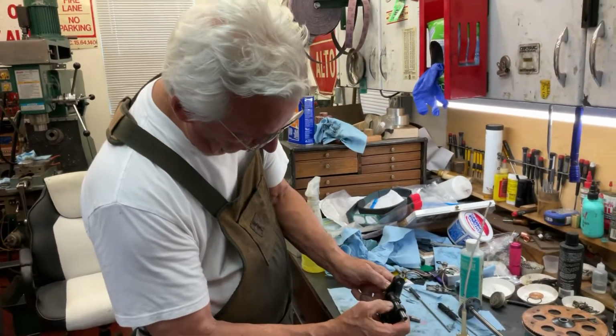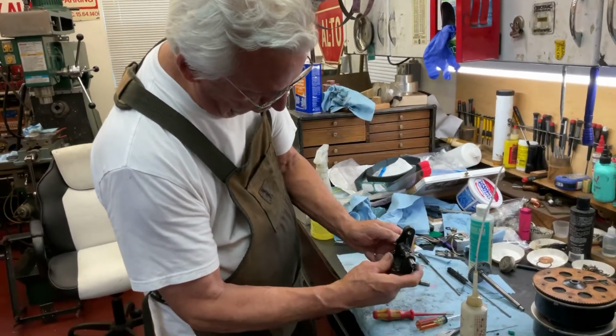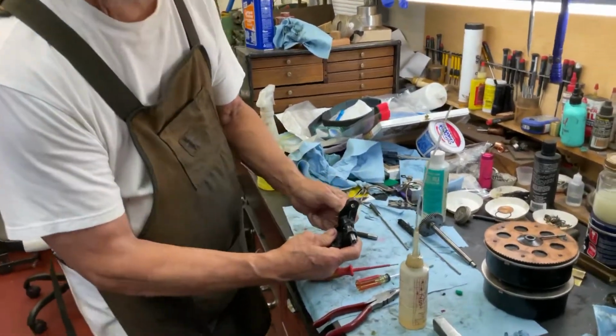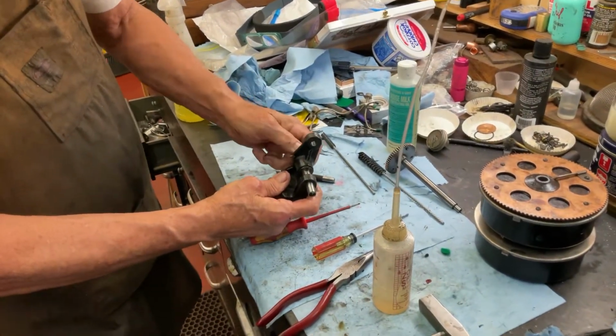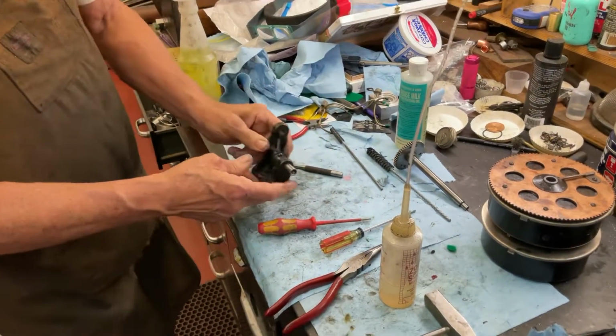And when you pivot it, when you crank, you'll see the washer moves. And that's why we put a little grease on this, because we see how this is all ready to go. Next video will be assembling the spring barrel into the rest of the casting of the diamond disc, and that's my tip for the day.